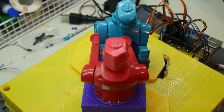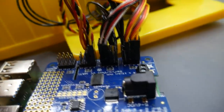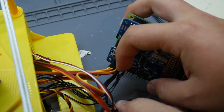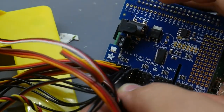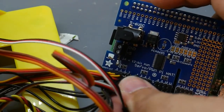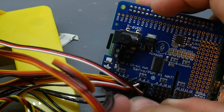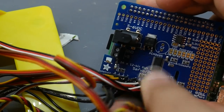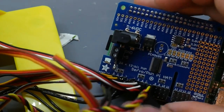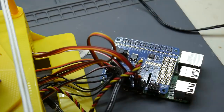This project was mostly mechanical and software design, so wiring up everything really was a breeze. With the servo hat, I just had to extend a few of the wires to reach the connectors on top. Pins 0 through 4 were for the blue robot, with pins 5 through 9 for the red. I chose a pretty beefy power supply to make sure all the servos had enough power, since several servos could possibly be used at the same time, increasing the load. I chose a 20-watt power supply, and that's worked fine.